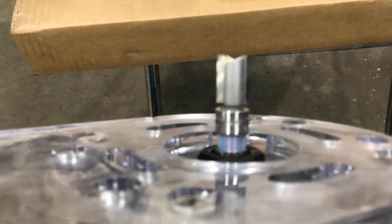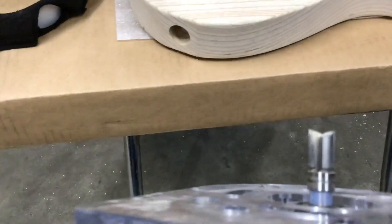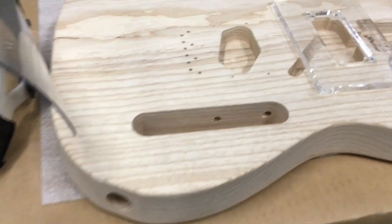Looking at this, I'm going to need to go deeper. What I want to do is place that whitish, bluish transparent spacer between the bearings and the blade part of the bit, move those bearings up and move the cutter down. I think what I'll do before that is go ahead and move the template over to the other position, use this as is, then set it up like that and do both of them in that other configuration. I was just measuring the pickup — it might need a little more depth, especially for wiring and stuff, but it's pretty close. The ends will definitely need to be a lot deeper.